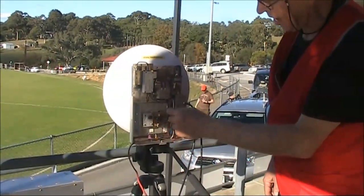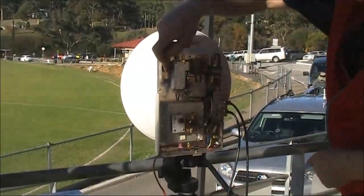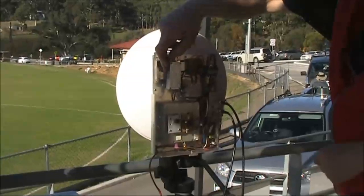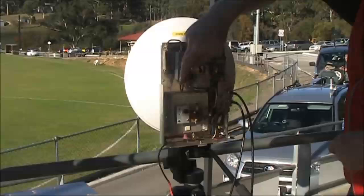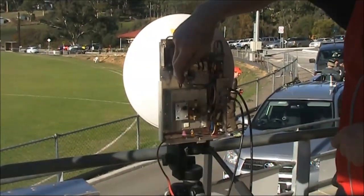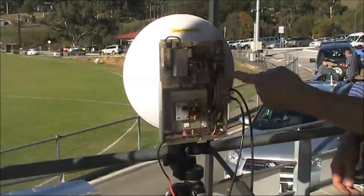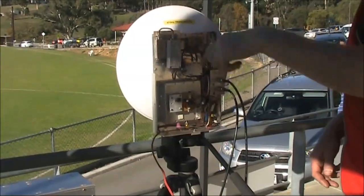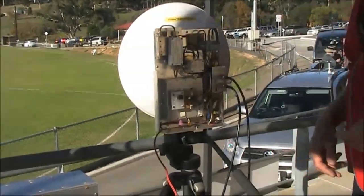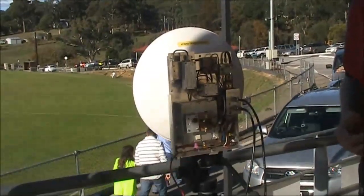So that comes out of there, it goes into this gadget at the back here, which is a times 2, up to 23 point something gigahertz, which is amplified there to about 100 milliwatts. And that just goes into a diode. That's all it's in. A diode mixer. The diode multiplies it by 2 and mixes it with 144 megahertz and radiates about 150 microwatts out. Not milliwatts, but microwatts.